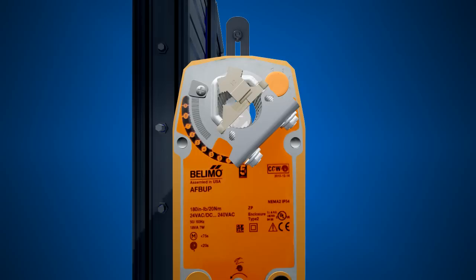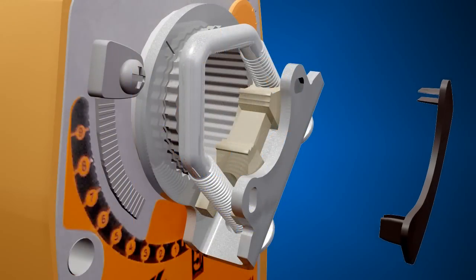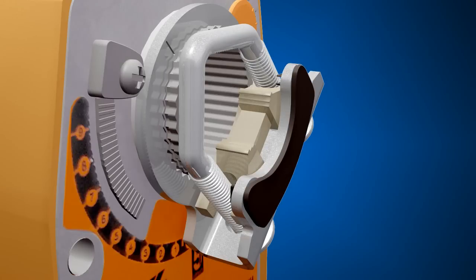The adapter can now simply be lifted from the tooth block. Reassemble the universal clamp without the adapter by allowing the tooth block to fall back to its original position and then replace the plastic faceplate. The prongs on the faceplate fit into the holes on the universal clamp, securing the tooth block in place.